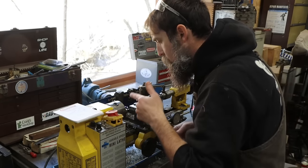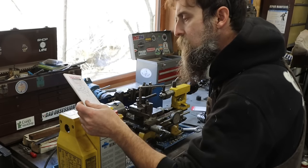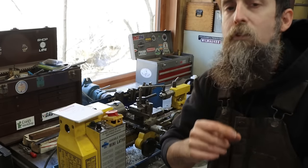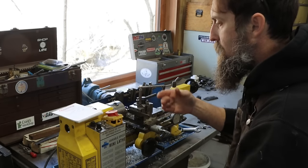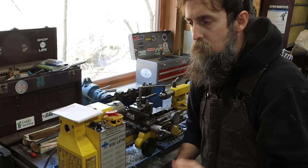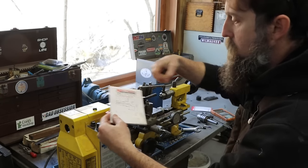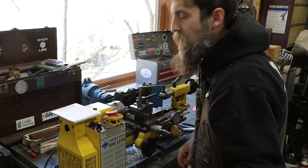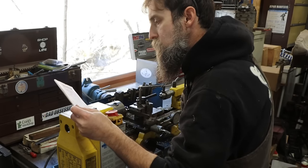So now, once my cutting edge touches the work, I need to feed in 211 thousandths, and then that'll give us what we can make easily of that second step. Then we will grind a custom tool on probably the bench grinder to get up into that spring pocket. That'll kind of be a trick. We'll figure that out when we get there. Let's see if we can't get this second portion of the step knocked out.